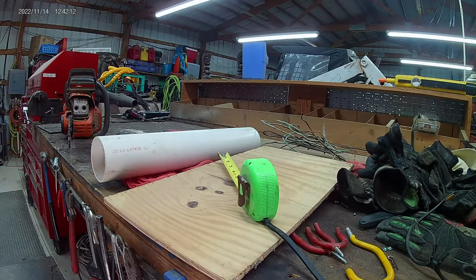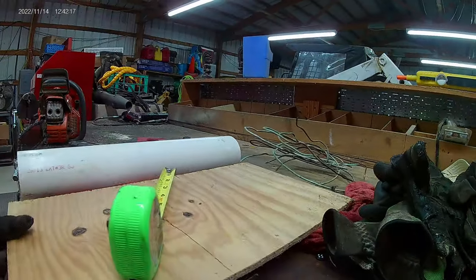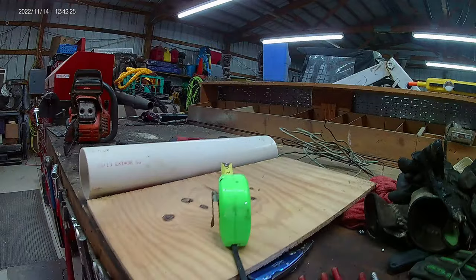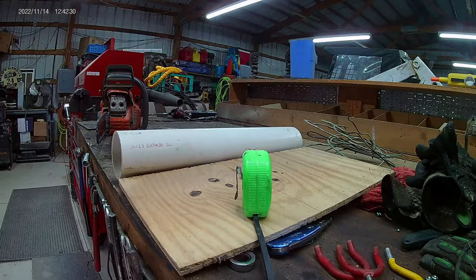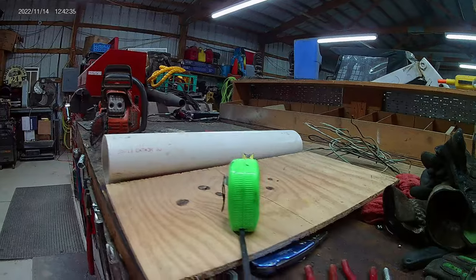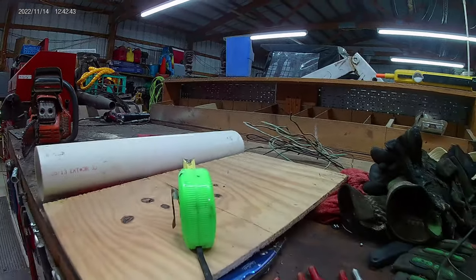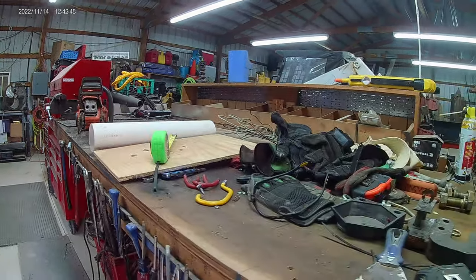and I'm going to cut it down the one length down to match the exact length of the pipe. I even made it slightly bigger, 1/4 inch bigger, I think, so I can make sure it would go through both ends. And now I'm going to cut it down to 3.5 inches wide, so it will represent the chainsaw blade with the chain on it. And then I'm going to attempt to heat this pipe up, slide this board in there, and sandwich this down, and make a chainsaw holder for the back of my Skidsteer.